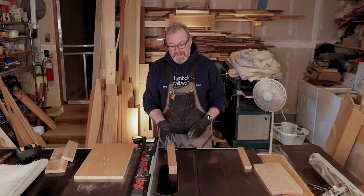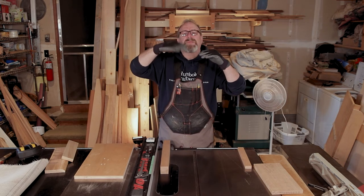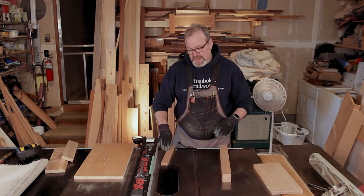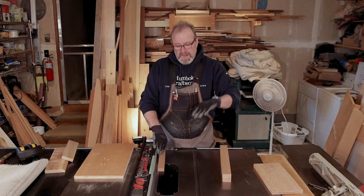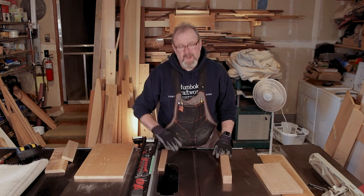But sometimes something weird happens. Your wood will start arching up and bouncing on the saw. And if you're new to woodworking, you don't know what is going on. You don't want to pull your piece of wood out. You don't want to keep shoving it through. You just want to shut the thing off with your knee, click, and hold on to your piece of wood until everything stops moving. Your table saw is done moving, and you can remove it safely. Okay, and that's that.